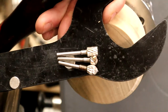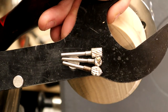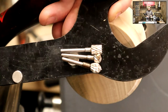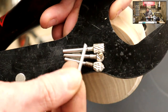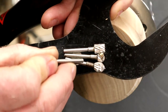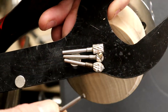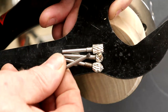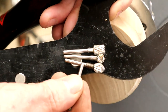Now, in reality, and I've used the right word, these are cutters. Why do I phrase them as cutters? Because these are a Dremel type of cutter. They are high-speed steel. They're what most of us would class as a rotary burr. They're a bit specific in what they've got. You can see up on here, they've got this little bit machined on, so the shank isn't dead straight. So I've got a magnet behind here, so I can just go up to there. There is like a stop point. If you go with a standard cutter, which is what I'm holding, there isn't a collar. That can cause problems. You need the collar so it rests on the bearing. If not, if I put this in and it hasn't got a collar, it's likely to disappear right down onto the bearing. Not any good. So you need to make sure whatever you're using here has got that collar.